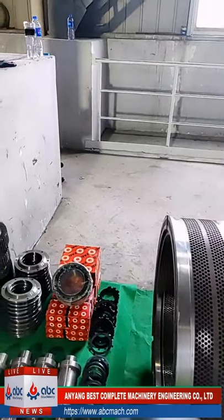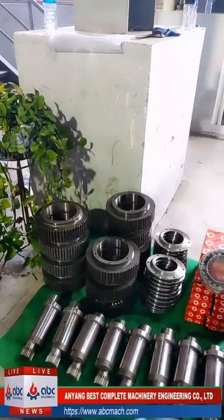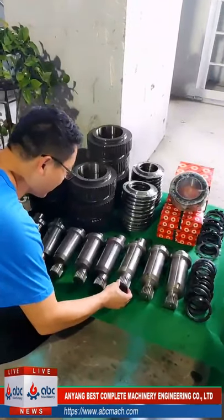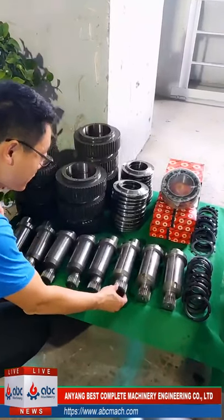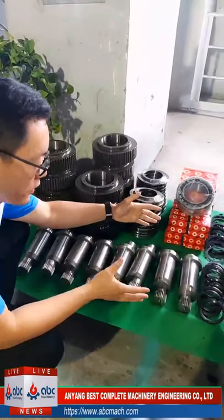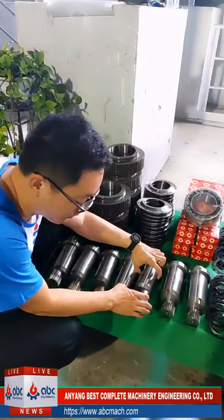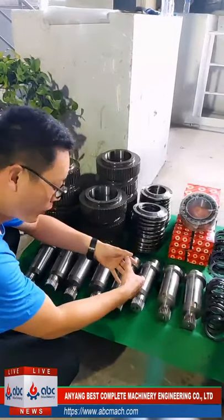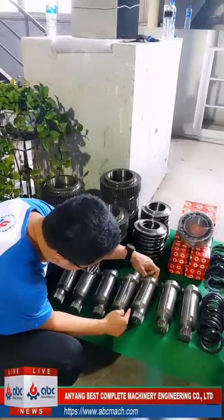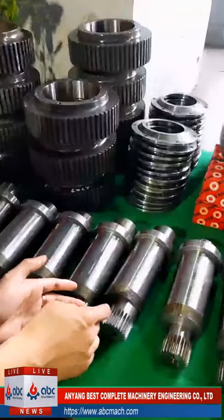And here you can see is the roller. Let me introduce it carefully. My assistant Fred has come here. Eccentric shaft. When you want to adjust the inside, this is the main shaft inside of the roller, which you adjust, and it is eccentric. We call it eccentric because this shaft center is here, but this rod center is here, so there are two centers. The diameter is not the same. I'll give you more details.